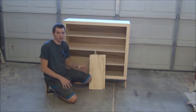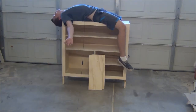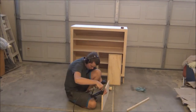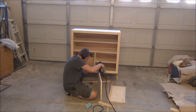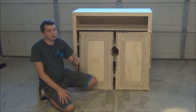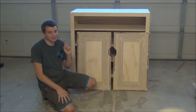Although this is not as important because we could cut these out later, I'm going to intentionally leave a small hole towards the top center of the doors that we can use as handles. As you can see, here are the handles slash door pulls I was talking about cutting out, and I also made sure to cut a 5-degree angle at the front of both doors where they meet up, just to help make sure they can properly close. And with that, everything is now built, and it is staining time.